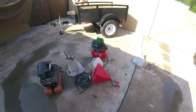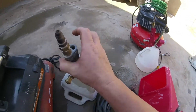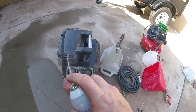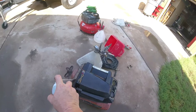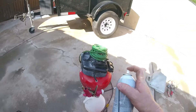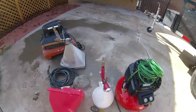Whenever you're done using your tools, you always want to drain the air out of the tanks. I like to spray a lubricant on everything — like WD-40. You want to get WD-40 on everything: inside the hoses, inside your air compressor fittings — basically spray everything with WD-40. A lot of guys say not to do this, but I've never had any problems. Basically it's good for storage — it keeps the mud from sticking. The mud will flake off and wash off, and it keeps everything lubed. Especially if you're going to store them for a long time. Spray oil down inside there and make sure everything's nice and lubed up.